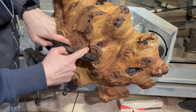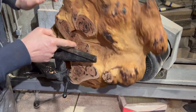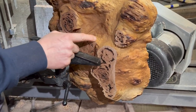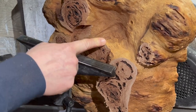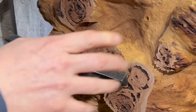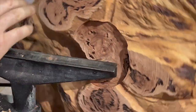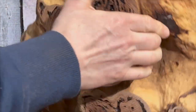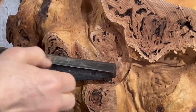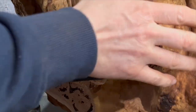My chuck can now fit inside that hole. I just need to dig out a chuck grip - I know part of my chuck grip is going to be missing, but it won't be a lot. I think it should be okay once I go down a bit further. Whenever I move my rest, I always turn the wood by hand just to make sure nothing's catching, nothing's loose. It's just a habit I do every time I stop and start the lathe again.